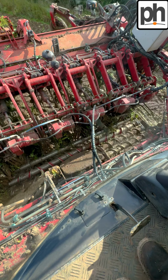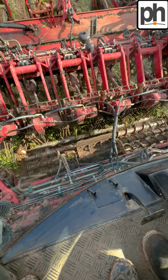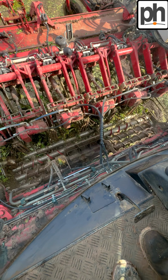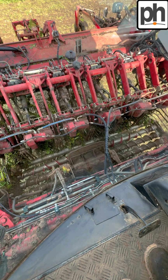So what you can see now, Steve's pulled up at the headland, you can see the roller deck. Now that also can clean off some of the soil that's on there, as well as feed the crop into the centre, where the paddle will move it back onto the webbing, which will again take more of the soil out before it hits the turbines and works its way up. So Steve is just lining it up now, ready to drop in on another run. Down it comes.